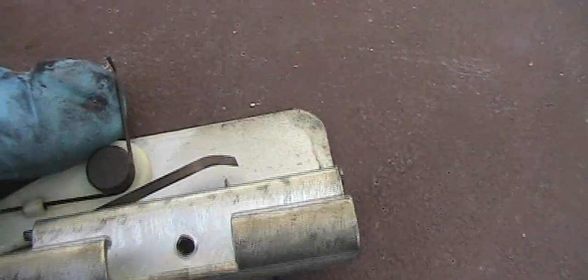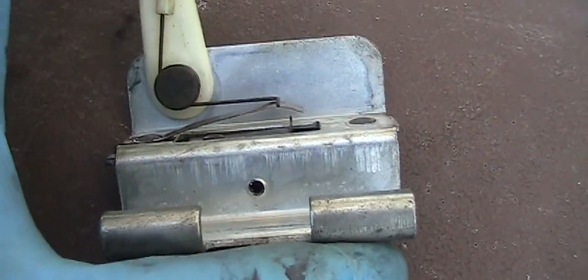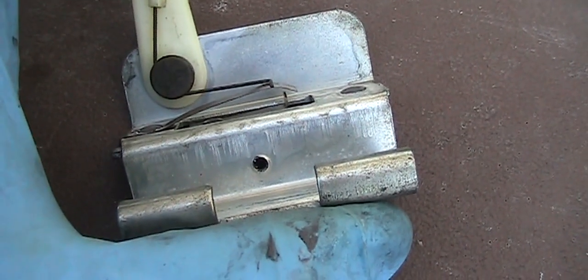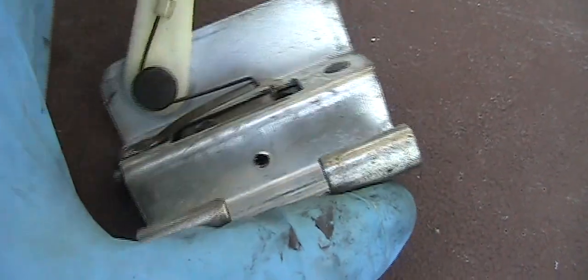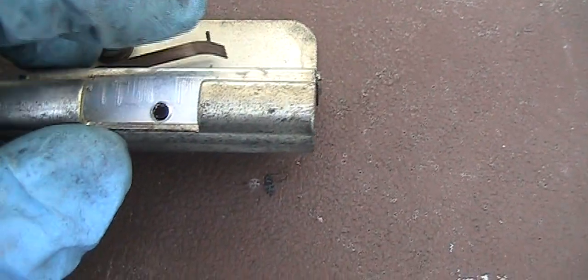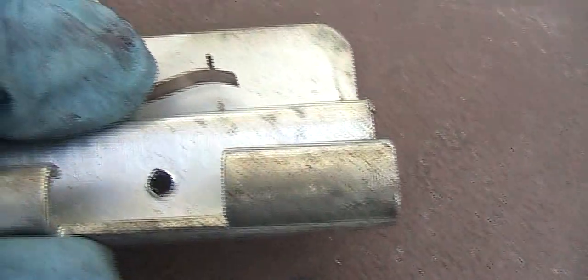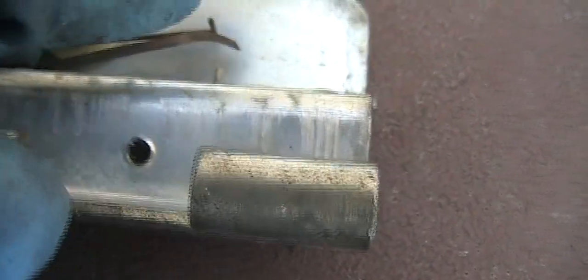What I found out is when the garage door hits this switch, you're going to press it down and make the connection, so it turns and stops the garage opener from continuing to move forward. So this is the part that is not touching, or sometimes touching. And I have a really black spot which I cleaned up already. I just use some sandpaper, roll it up, go inside and clean up all the corrosion or grease or anything.